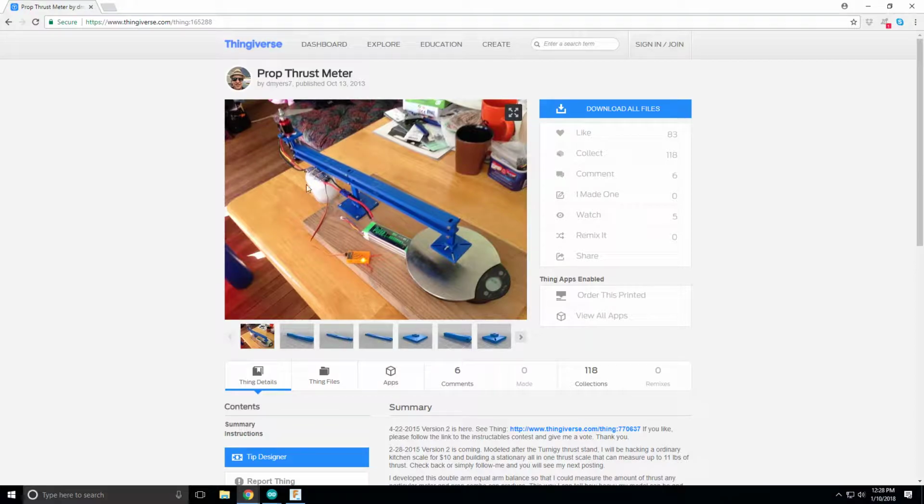And then we want to measure torque. So torque is force times distance. To determine the torque, all you have to do is find the distance of the moment arm. And we're just going to assume that this is straight. Let's just say that this motor was attached right here. Because if it goes up like this, you have to take the cross product, which we're not going to go into. We're just going to treat that this is attached to the top here.